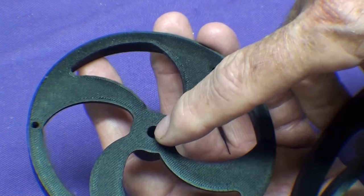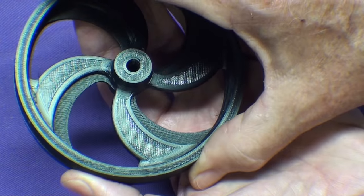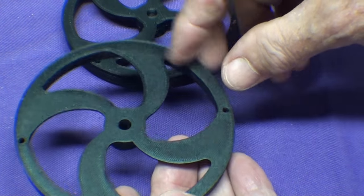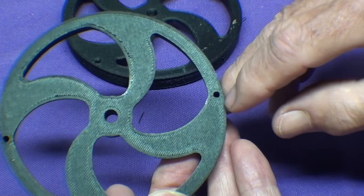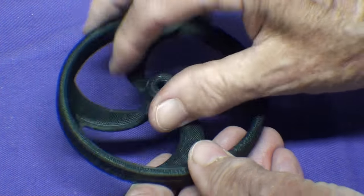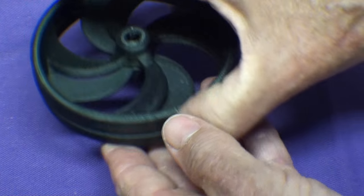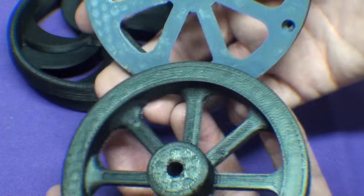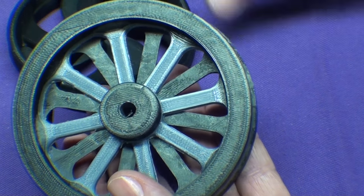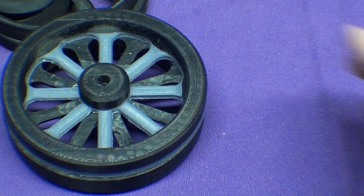These patterns need to be reworked before they can be used. Primarily we need alignment pins. I'll easily be able to make an alignment pin in the center that will center it one way, but I need at least one more pin to center it the other way. I also need some holes to put screws in to withdraw them. There are some existing holes but they don't seem to align with one another, so I cannot use them. I'll go ahead and do that work, some of it I may show and some I may not.